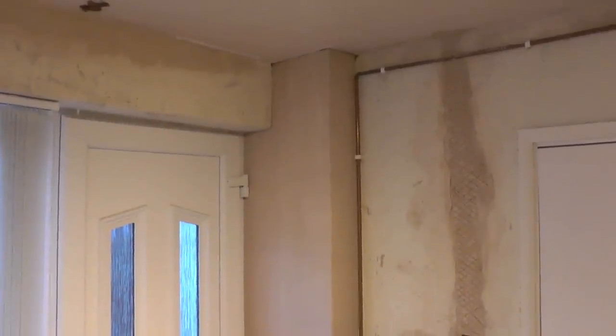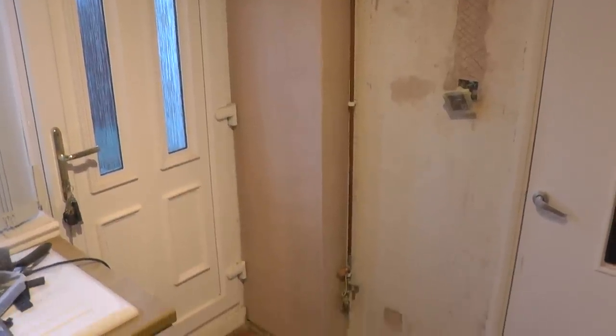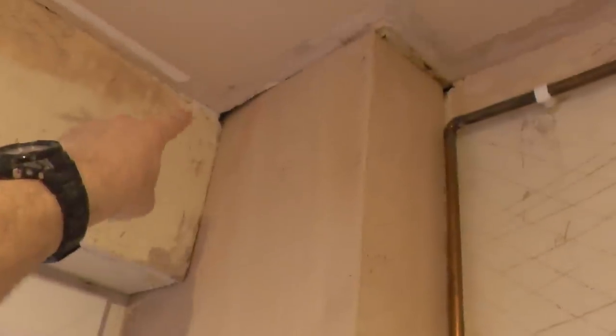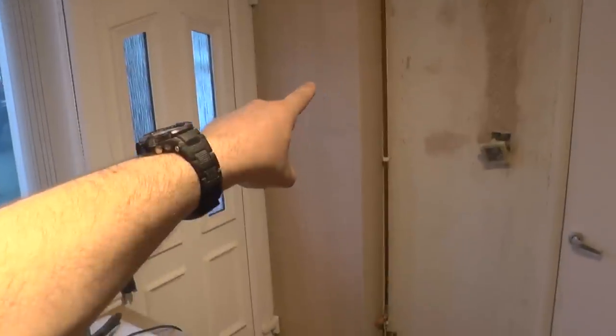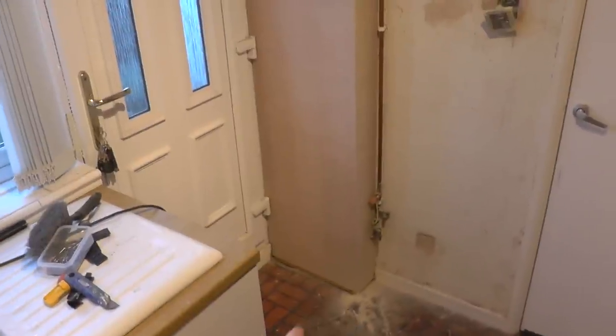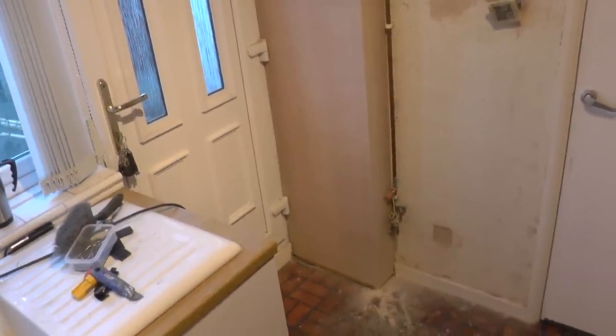Right folks, the project is now complete. It may not be the best bit of carpentry you'll ever see in your life, but it's not the worst either. So these pipes — this soil pipe — has now been boxed in. It's absolutely rock solid. I've sanded down the edges and got the best fit I can within my skill set. Any little areas like this I'm just going to fill in with some plaster and a skim sealing. I've just tacked the panels in using some little panel pins, so that's absolutely solid now. On the edge down the bottom there I made a slight miscalculation in cutting the board, so there's a little gap which I'm going to put some wood filler in, but realistically you're not going to notice unless you look for it.